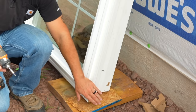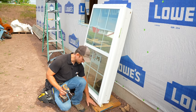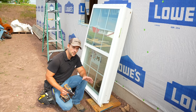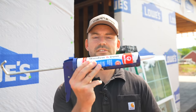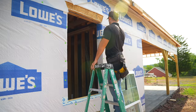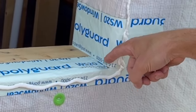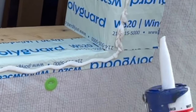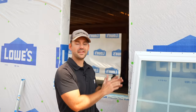Windows often come with a board screwed to the bottom so you can set them up without damaging the nailing flange. It's held by just a couple of screws, so we remove that before setting the window into the opening. I'm now going to use the silicone caulk and go around the whole opening, staying within about a half inch to an inch of the edge so it seals to the nailing flange. Also put a small bead in the crease to cover any cracks.